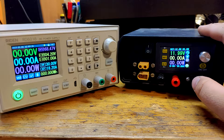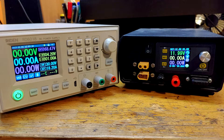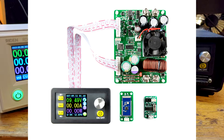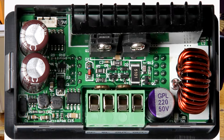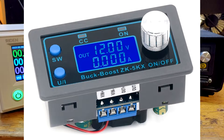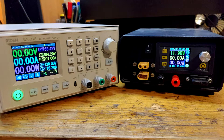DP-like series have compact dimensions so we can place them almost anywhere. Just keep in mind that most of them have not only the panel module you see but also an invisible power electronics module. Only the weaker ones like DPS 5005 could fit all in one in the panel module. Unfortunately both DPH buck-boost series have an additional PCB, so if you want a buck-boost supply you need to buy similar ZK5KX — that is way too primitive compared to DPH but at least it fits all in one panel module. Riden power supplies can be placed in many pre-made boxes and of course you can make your own just like I did.